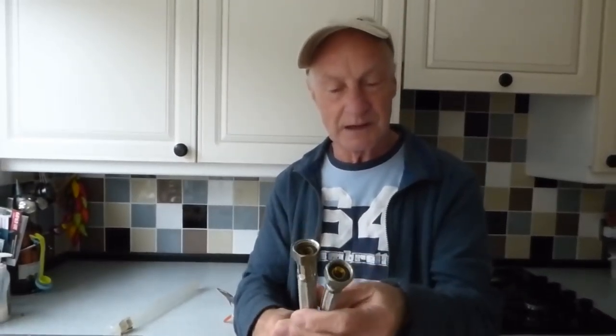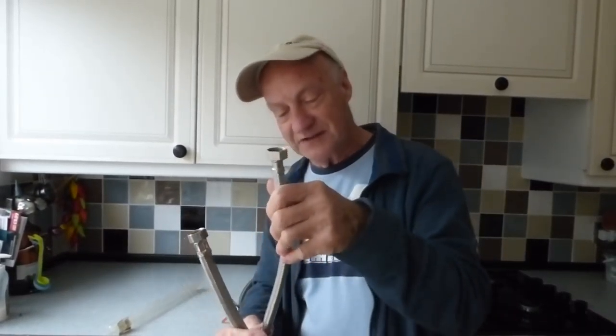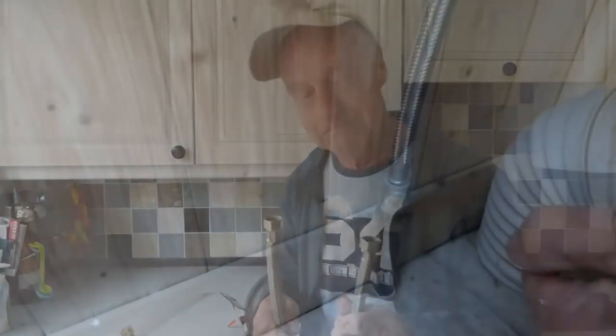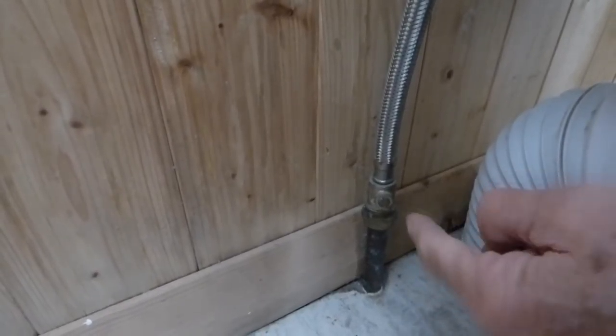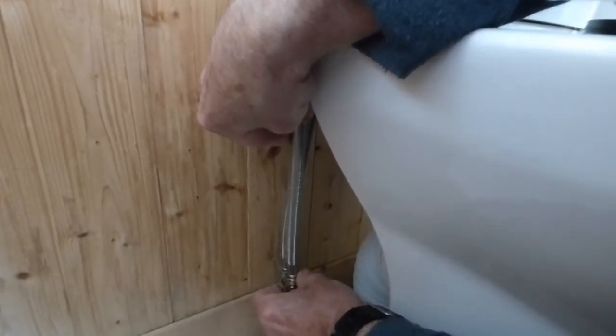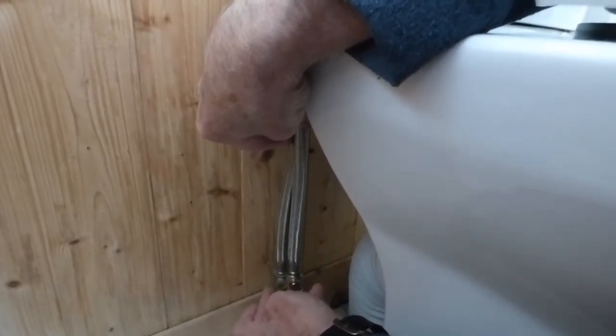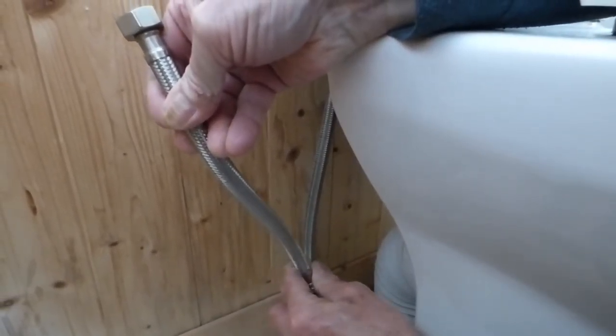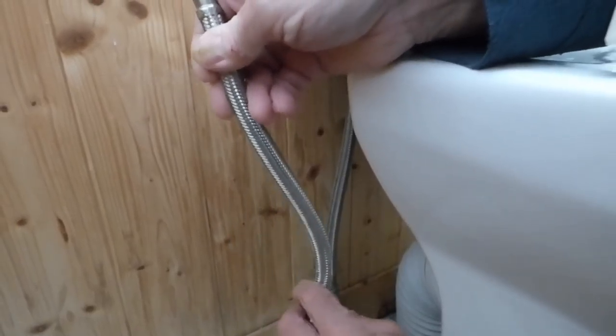The last question I've been asked is how to fit these — how much flex do you give in them? Because you can bend them and bow them, of course. I'll show you one I fitted into a toilet system upstairs which is about the right amount. As you can see, it's just a nice gradual bend on the flexi up to the nut on the system. When you offer these up for cutting, you literally just get it around about right where the nut's going to go onto the valve, and just give it a little bow — a little bend down — so you get just a little bit of a bend like that.